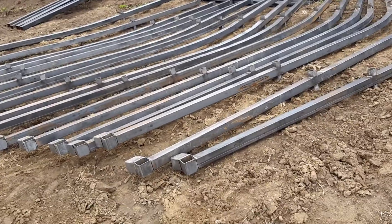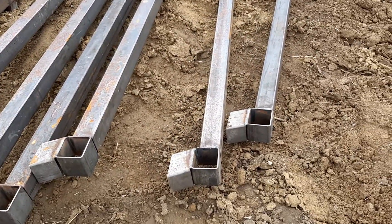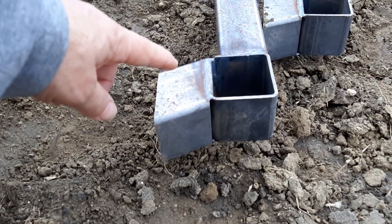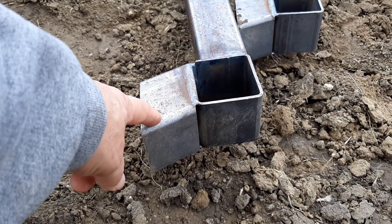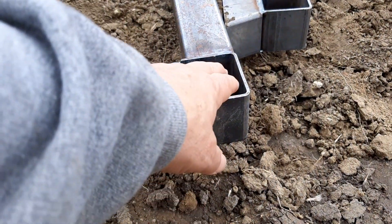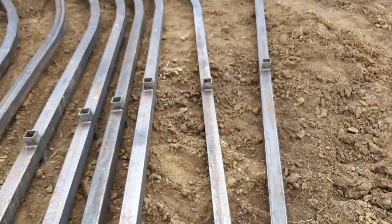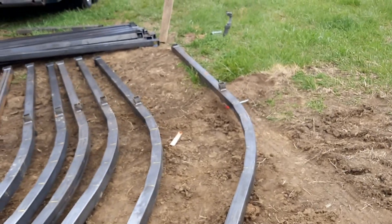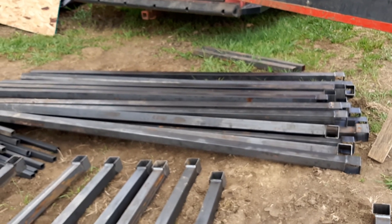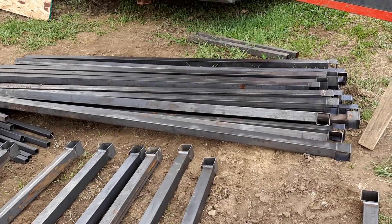At the top of the arch is what we call a gooseneck. That's a fabricated piece — something they weld on. And right here, this is where the north beam is going to fit in, and this will be the top — this will be the peak. So this is the gooseneck. What fits in here is 18 of these, what we are going to be calling north beams. That's because they go in on the north side; they go straight up and down and they connect at the top. And we're going to use self-tapping screws.